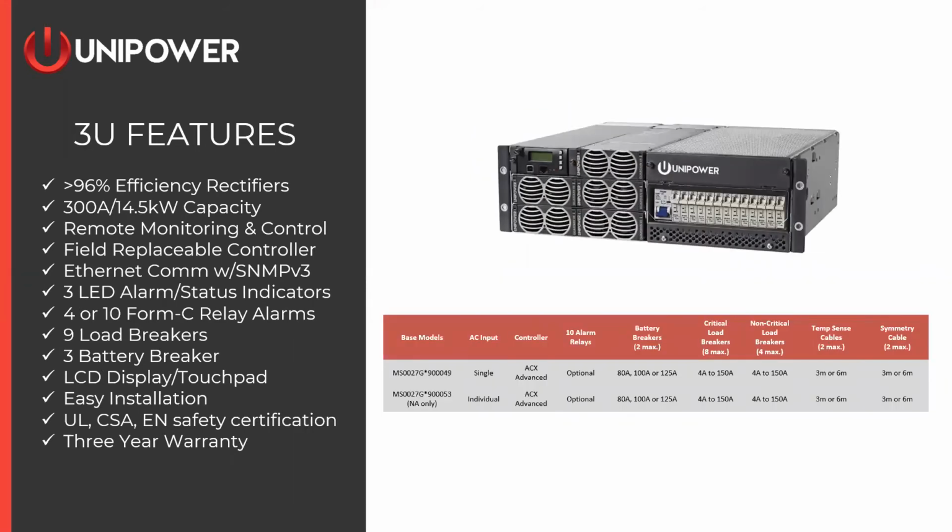The 3U features, very similar. Same modules, again, same controller, up to 300 amps on this system. Remote monitoring and control is still done through the PALCOM system, through the same ACX controller. Ethernet is secure SNMP v3, status indicators. The difference here is this unit in 3U configuration versus a 2U configuration, you can get up to 10 Form C relay alarms as opposed to the 4.